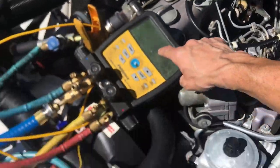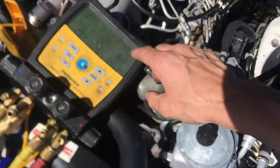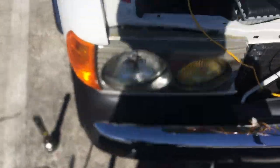79, 80 degrees — it's roughly 80 degrees pulling over the front of the condenser. We're at 260 on the high side. That thermal fan is my only concern. The dye is working and doing its job.